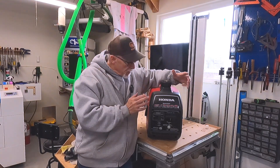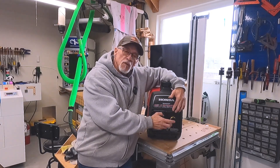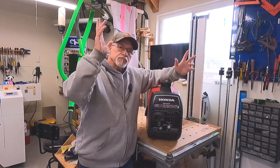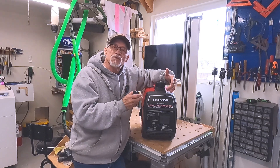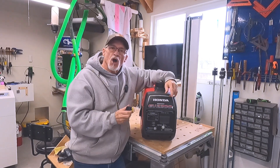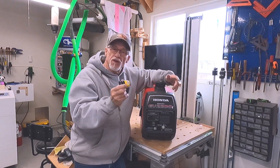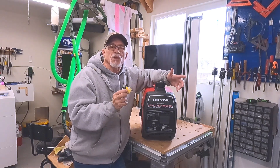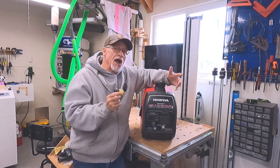So anyway, I plug the neutral ground bonding plug into one of the receptacles on the generator, run my extension cord to my furnace on the other, and it seems like everybody's happy. It didn't take much of a solution to make all this work — a simple three-pronged male plug, put in a jumper between the neutral and the ground, and you're off to the races. If you're not comfortable with doing that, you can always purchase one of these plugs on Amazon, and it's called a neutral ground bonding plug. That's what I had trouble with — I didn't know what this thing was supposed to be called and I couldn't pull it up.